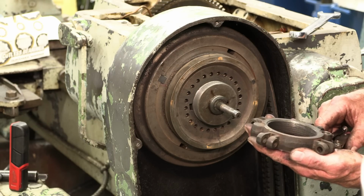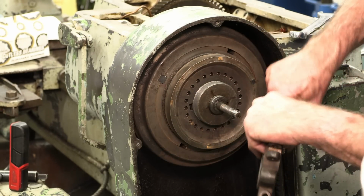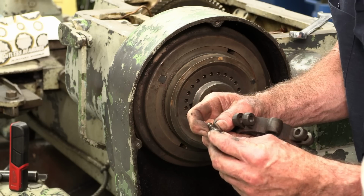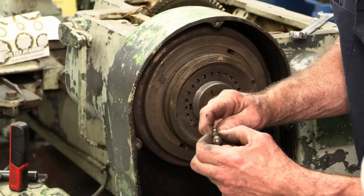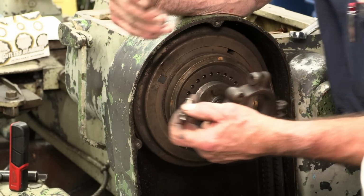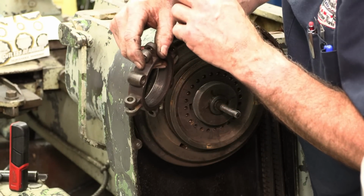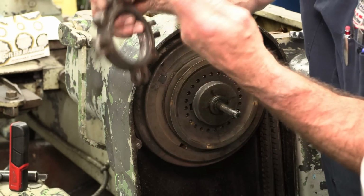Little bead blasting, and there's that pin, and we'll look at. Sometimes I think I should put the cover on there, but okay. The spring. We'll shop for springs, but the spring should always be keeping that indented there. It shouldn't be loosening around. When we were test running this the other day, you kind of heard that clink, clink, clink, clink. And actually, it was between those spiders and this little thing right here that was giving almost a bell ring that was in that video. If you go back to it and listen to it, you'll hear it. And this is what was causing it.